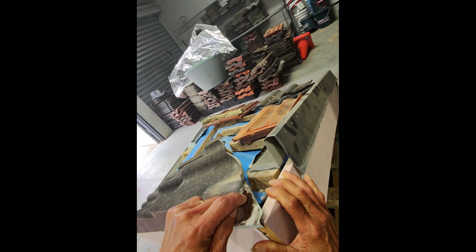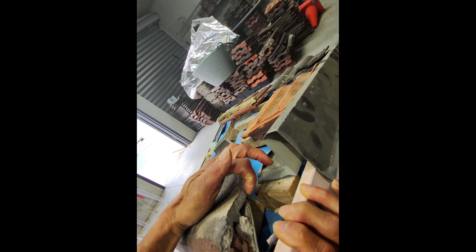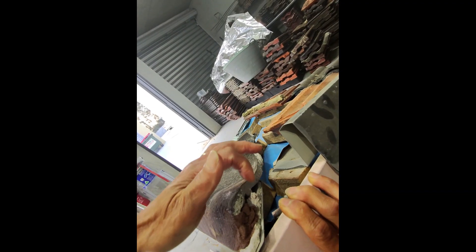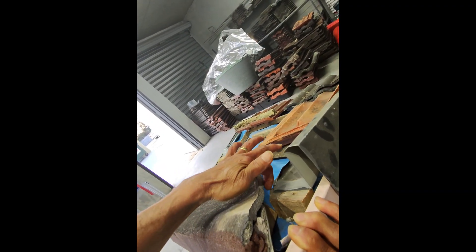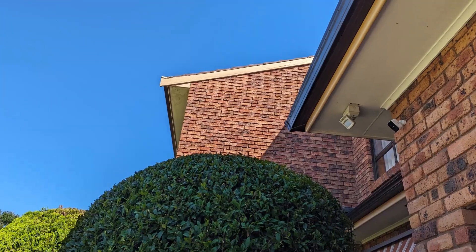What happened is that when you do get cracking and water seeps in onto the bedding, it will go on top of the fibro. And because the fibro has got a free edge, it sometimes drips backwards — a lot of water goes off the fibro and into your roof, so you get a leak along the edge of the roof.